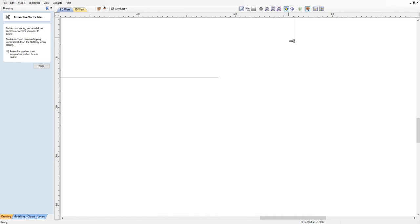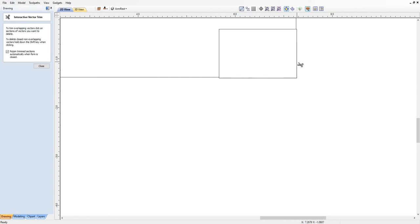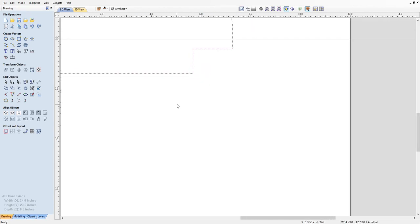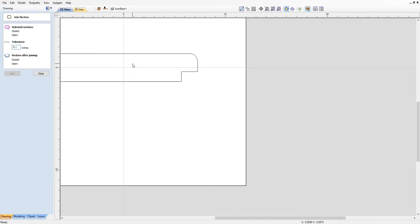Now, this piece I'm cutting out right here is to go against my dados on the armchair. This will go on the side, and then what I did is glued a piece, I screwed it on and then covered it up with a piece of dowel is all I did.